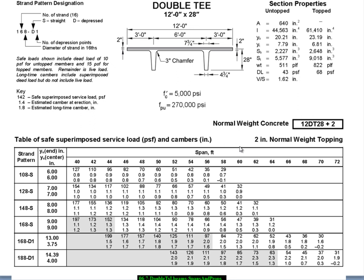Targeting around 80 to 100 pounds per square foot, the table shows 85, which means we can safely superimpose 85 psf — probably perfectly satisfactory for this design. However, the one issue is that D1 designation. Knowing from prior industry feedback that they'd prefer to avoid the center depression if possible, we're going to jump up in the table and go to a deeper beam.